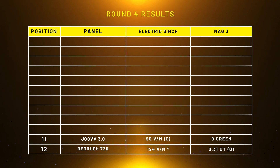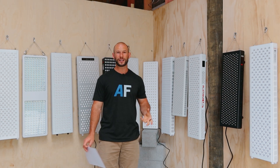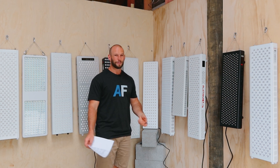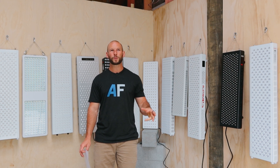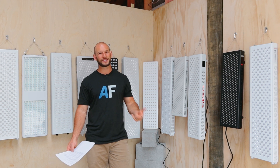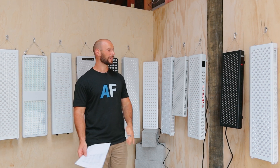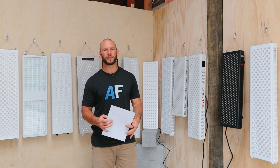In 11th place was the Juve Solo 3.0. What's interesting here is this had a really, really good magnetic reading — in fact one of the best from a magnetic point of view — but it had a really high electric field coming off it. The reason is they don't use a grounding pin in their plugs. It was the first thing I noticed when I got this Juve many months ago. I was so concerned about it I actually tried to use another cable from another panel, but the other cables didn't work — Juve uses their own special cable. I really don't know why they've done that. When they transitioned from the Juve 2.0 to the new 3.0 they changed manufacturing plants — now they're making these panels in Malaysia. But it's seriously such a simple engineering fix to add that grounding pin, and that's why you're getting such a high electric field. Even though the Juve has a really good magnetic score, because of their electric field they come in 11th place, which is really unfortunate because it's really just a bit of an oversight.